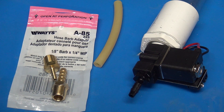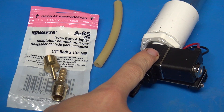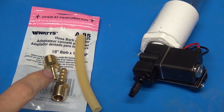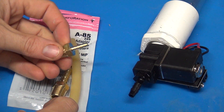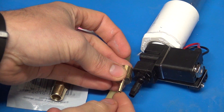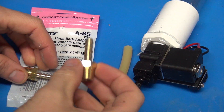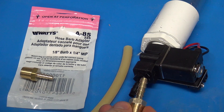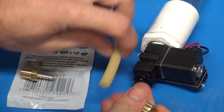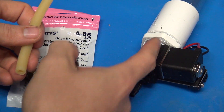There are lots of ways to do this, but what I decided to do is to separate the reservoir from the valve and then join them together with a piece of rubber tubing. These are the three parts I needed to make this modification. I chose to go with a smaller 1/8 inch barb to replace the bottom barb. And then I picked a big barb — I think this is a 1/4 inch barb — to match the other barb. I'm going to put the tubing between them and we should then have the solenoid disconnected from the reservoir.